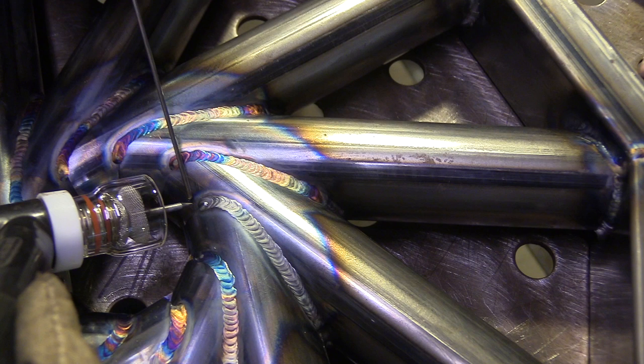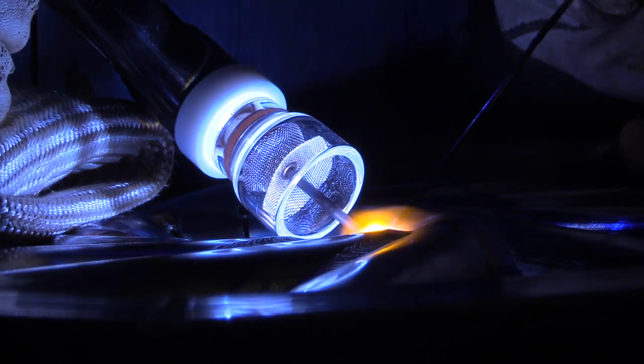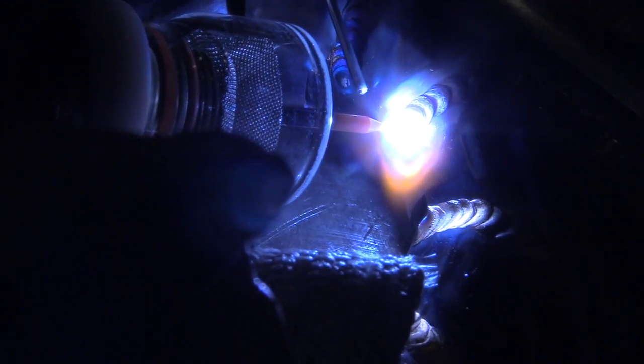I've got about a half to three-quarter inch to weld here, kind of downhill, so I'm going to violate every textbook rule on rod angle and things like that — I'm just going to go downhill and feed the wire in from the side. Sometimes you just have to do that. Jobs are all different, and what a textbook recommends as far as where you feed the wire in the puddle sometimes just doesn't work.